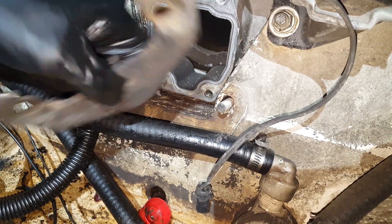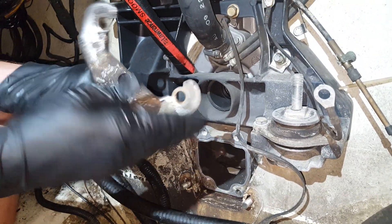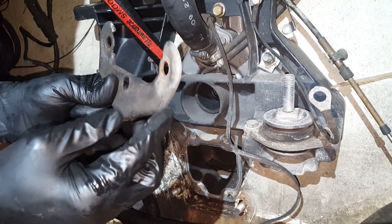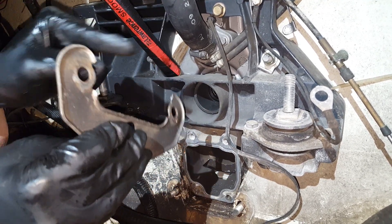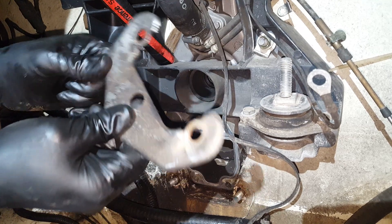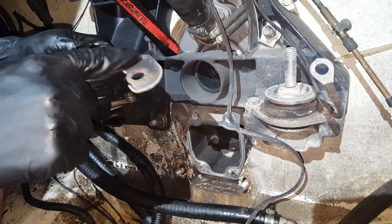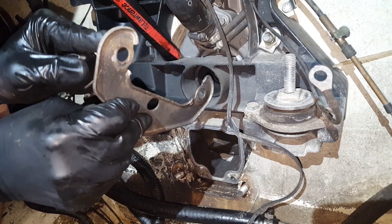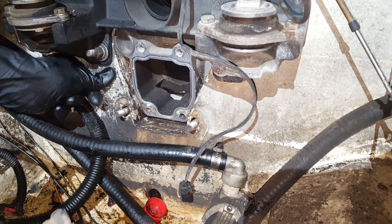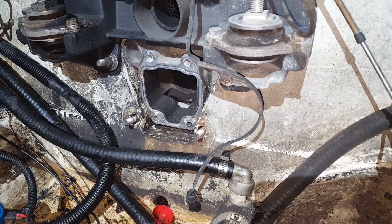This little metal piece will come out. Just so you know, this piece is supposed to be completely flat. Since the transom is rotted, what happened is — as you hit waves in the water, this part stays flat on the fiberglass but bends with the transom plate, so it's definitely compromised. What we're going to do, because this is still a good piece, is lay it on something flat like a piece of metal and hammer it flat again, because it needs to be flat for a good grip. I can press on it right here and on camera it's soft — without a doubt that transom is rotted.